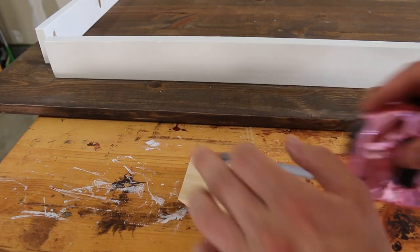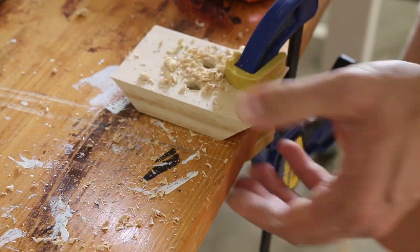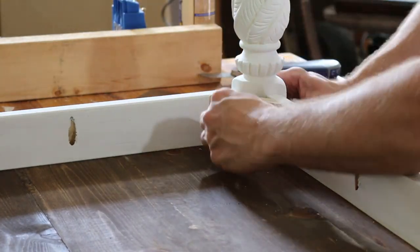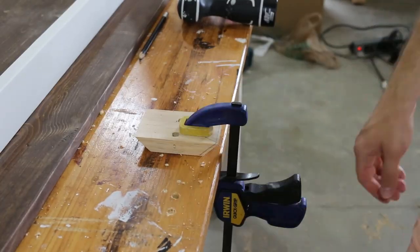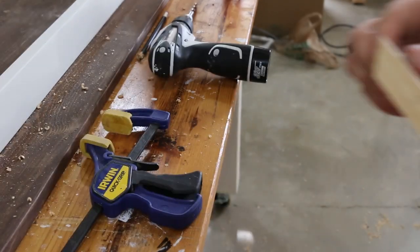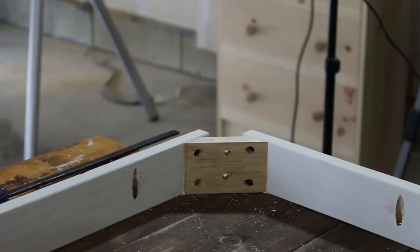I measured the center of each mitered piece, which was about two inches, then pre-drilled two holes to accommodate the bolts that go into the legs. By using washers you can make the holes a little bigger to give wiggle room if they're not going right into the holes on the legs. Then I took my Kreg drill bit and drilled at a 45-degree angle — four holes, two on each side — to attach the mitered piece to the apron. I secured the mitered pieces to the apron using one-inch screws, then finally attached the legs.